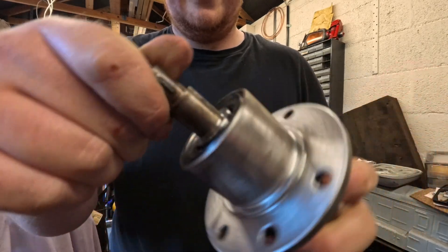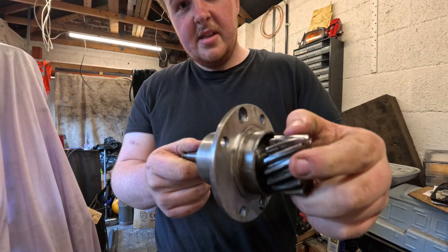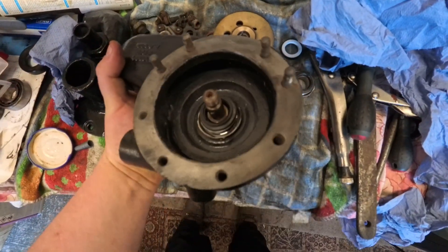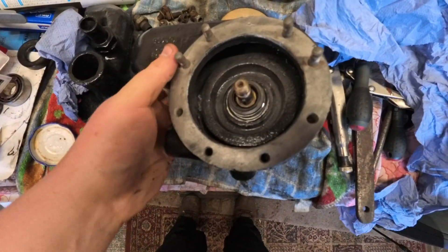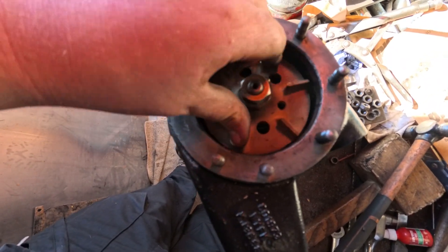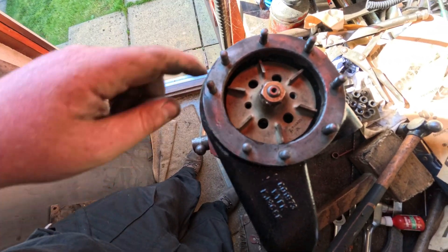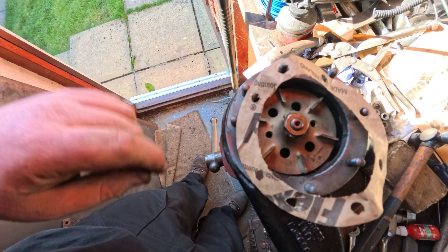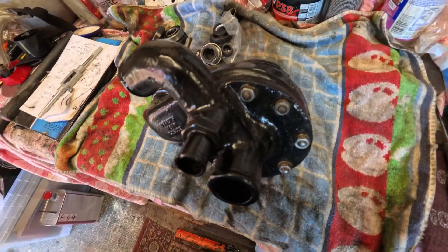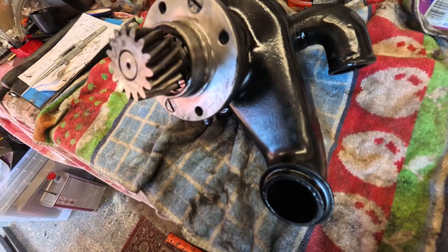The cartridge part that contains the bearings and the gear that drives the pump on the pump shaft is all back together. I've pushed those back in and there's a retaining circlip that holds the whole cartridge piece together and the bearings in - so that's all running nice now. The oil seal has been pushed into the housing as well. So this is now going to go back into the water pump casing and we can get the impeller in and pretty much all done. I've given that a little clean up on the flange faces before it goes back together. That's the drive unit all back in place now with the spindle sticking through for the impeller.